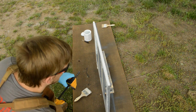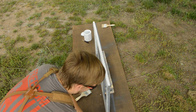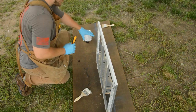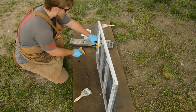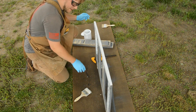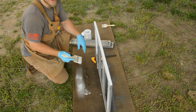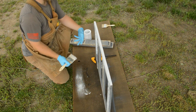One thing I'm going to try: I want to paint both sides at the same time to save work time. I'm going to use these clamps, clamped in opposite directions, kind of like feet, to hold the piece up. That way I can get both sides of my web frame and go back to paint the back end later, but I can put an emphasis on all surfaces that might possibly be seen in this project.